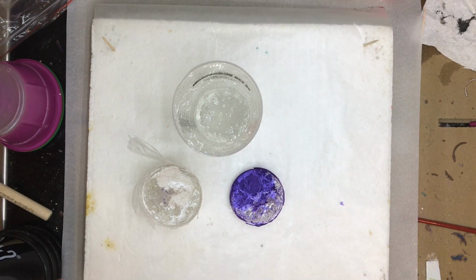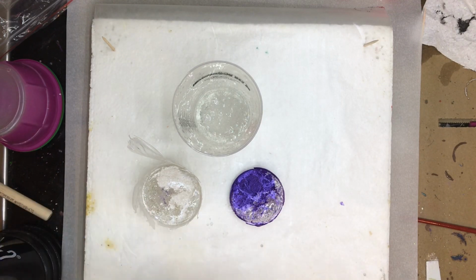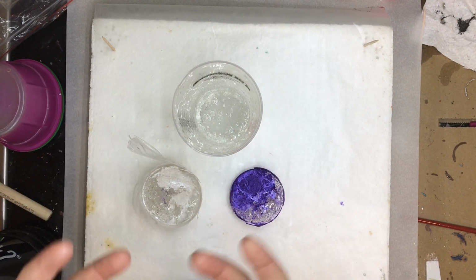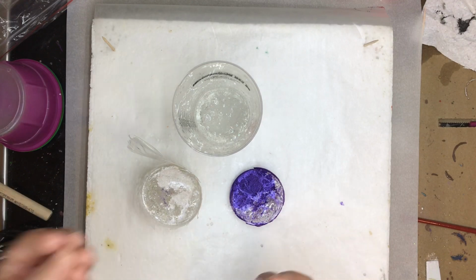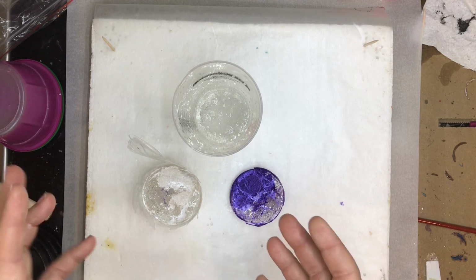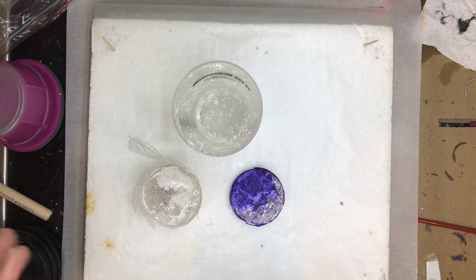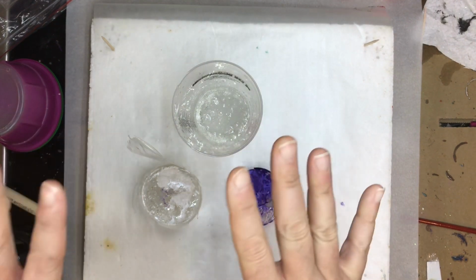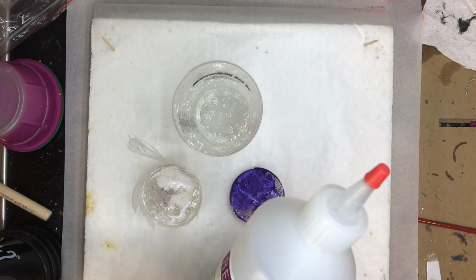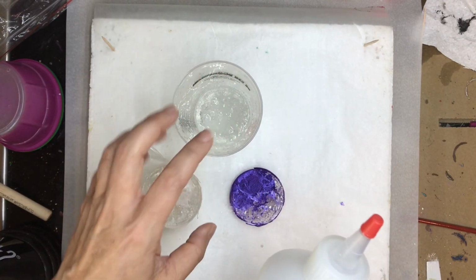So we compound that with, I mixed the maximum mixing amount for this resin, which is 3 ounces. Now, when you guys are working with resin, you should feel the 2 parts warm up, right? You got resin, you got hardener, you put them together, a chemical reaction occurs, and that's important because that heat is what warms up the resin. However, there is too much of a good thing. And so I mixed 3 ounces, which is the maximum. So when you warm up your resin, that heat also helps to jumpstart things. So I was already mixing the maximum and then I added extra heat to it, okay?